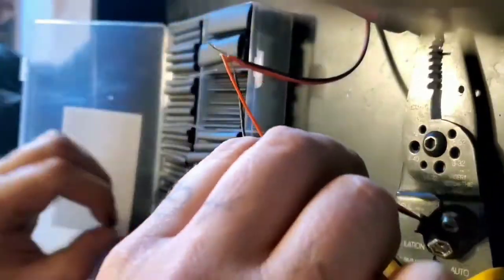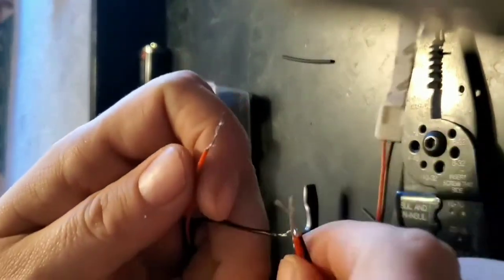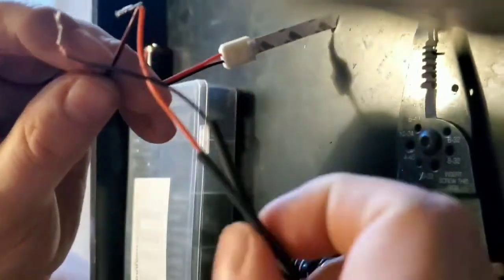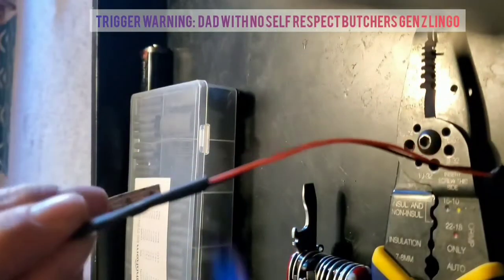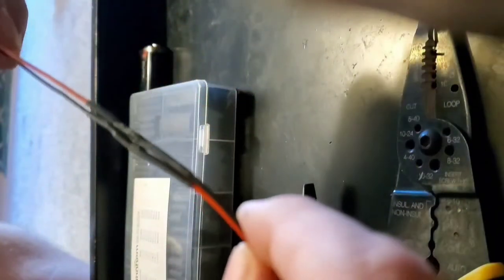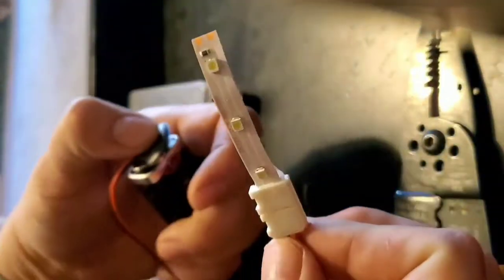We want to select the right size of heat shrink — something about the same size as the wire, just slightly bigger, because even though heat shrink shrinks quite a bit, there are limitations. So I slip on the heat shrink, twist the wires together, and slide the heat shrink back over. Now that it's properly covering the exposed parts of the wire, time to get lit. And just like that, it's like magic — it's just that easy. Now that our harness is complete, it's time for another quick check before we wire this through our mask. And bingo! It works perfectly.